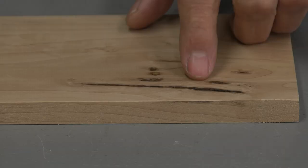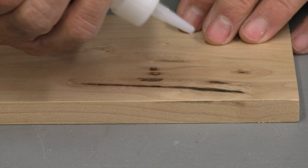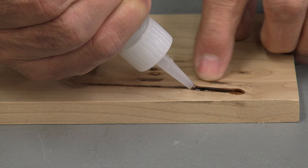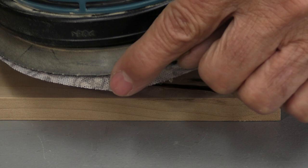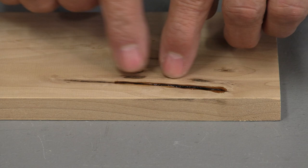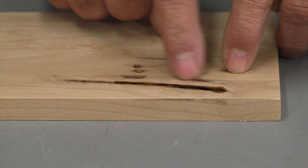Before I show you the proper way to fill cracks and voids, I want to show you what not to do and why. First, you don't want to use clear glue. Also, unless you've got a big crack, you'll want to use a tip — don't use the end of the tube directly because you end up with a big globby mess. When that dries it leaves a lump, and when you bring your random orbital sander to sand it off, the glue is usually much harder than the wood. You end up sanding the wood but not the glue, leaving a gully all the way around where you've done the repair.